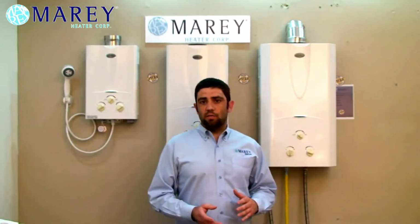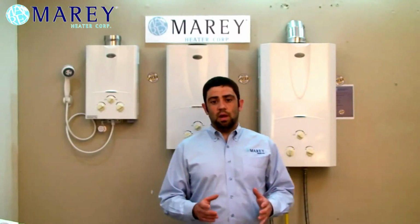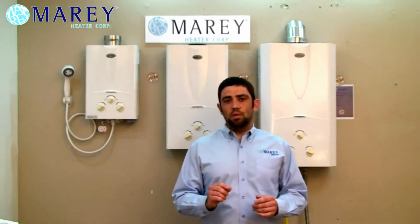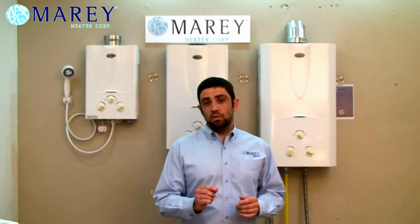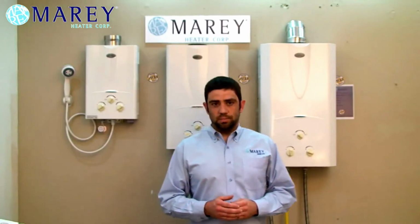It's not necessary to have a wall outlet for these units, and the reason why they have batteries is because typically when you're replacing a standard tank water heater, it has a standing pilot light, which means it has a small flame at all times, and therefore it doesn't need electricity. Well, these do not have a small flame because that is wasting energy. So we allowed these to be started with the 2 D-cell batteries, and it makes for an easier installation.